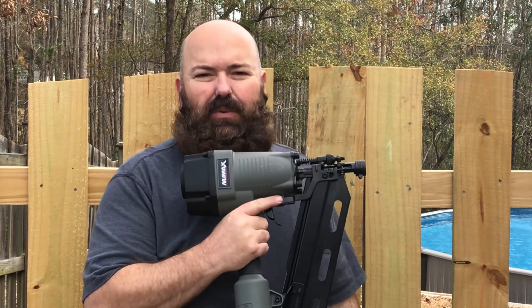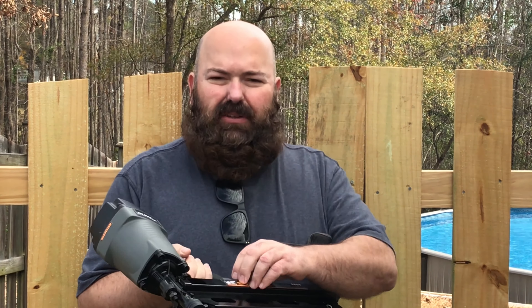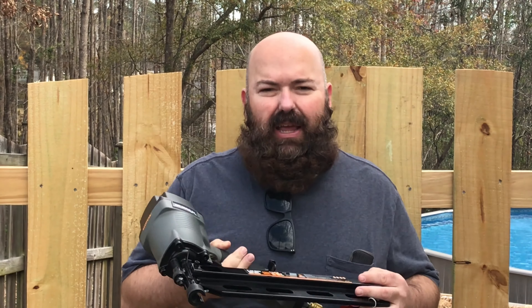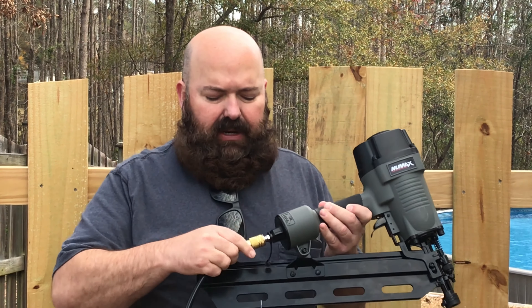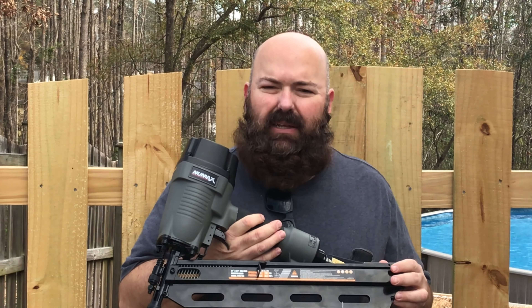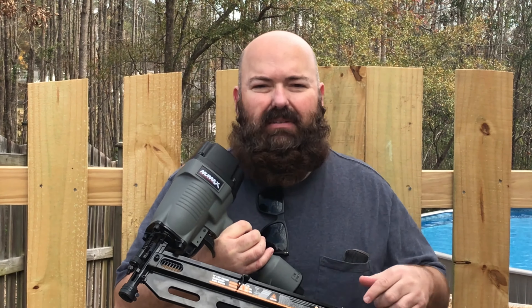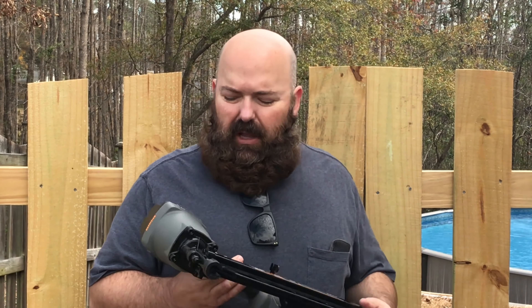That's it — we've gone over the new Max 21-degree framing nailer: the trigger it comes with out of the box, the rapid-fire trigger, how to change the trigger, how to load it, and how it fires. If you have seven or fewer nails in the nailer it won't fire — that's the anti-dry-firing mechanism. The air inlet is a quarter-inch MPT connecting to a quick connect fitting. I found this is the same dimensions as the Freeman PFR2190, except it's a nicer color. The Freeman comes with a seven-year warranty versus a one-year warranty on the Max — that extra thirty dollars might be worth it for some, but for me this was perfect. I put up all the fence boards quickly in minutes instead of hours.